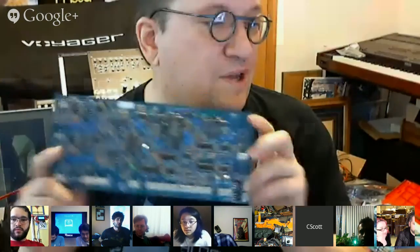So when I went to make my voice card, I had to build discrete equivalent circuits of each envelope generator. They're 2 quadrant multipliers. They use 2 exponential converters, one when it's positive going and one when it's negative going. But there's 2 sets of those because there's 1 filter envelope generator and 1 amplifier envelope generator. That was the toughest part of the whole project.